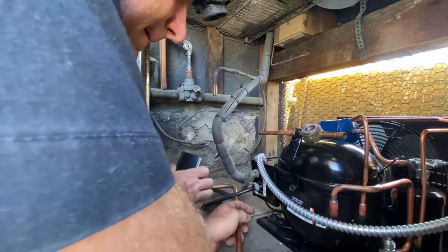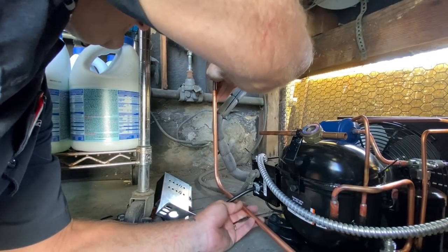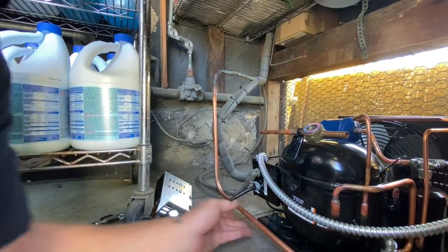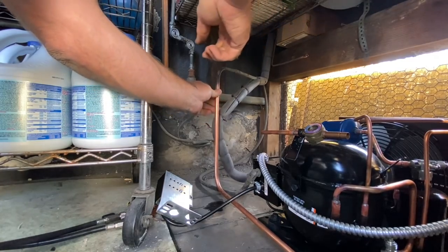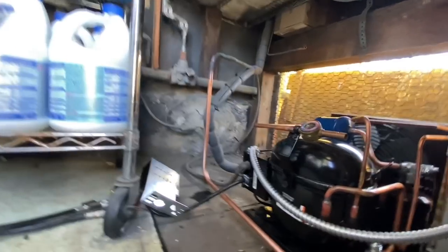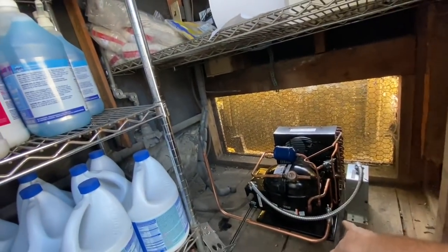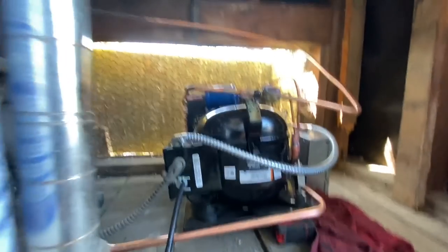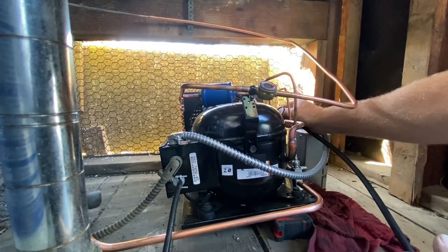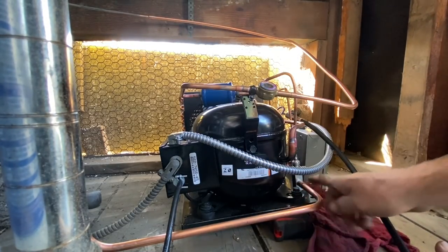Let's put the pressure switch out of the way. I'm going to get that in there like that. It's going to look like that. Let's see if I got some insulation on the truck. Then we'll get ready to make this first weld here, and all the liquid line ones too. We'll let that build up some pressure through there — it's going to take a little bit of time. It's going to go out through the evaporator coil, come back, and then back out right here.